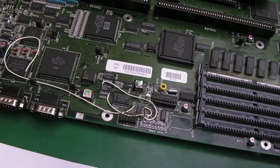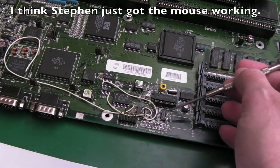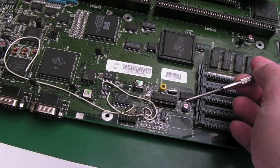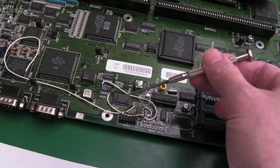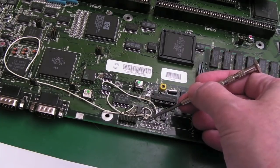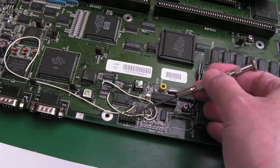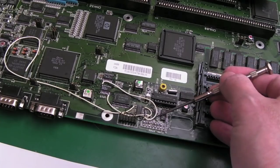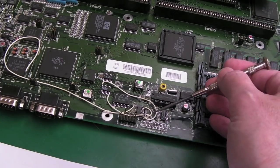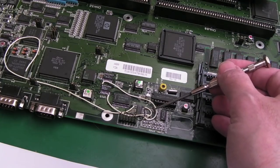And I think the way Stephen got this working is just hardwired it. It might be reading either all lows or all highs. It's got to be, because there's only one chip here. It can't read anything from this chip. It's not there. And I did wonder, whilst it says the first 2 bits of hard coding should be high, I've measured that. I went on the Amiga PCB Explorer and looked, and the first 2 bits on the chip that's here that's missing, I think it's A and B, are wired to high. So, sorry, is it ground? So yeah, the first 2 bits should be ground, actually.